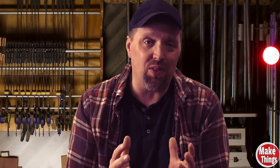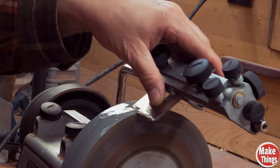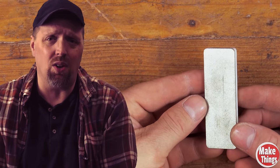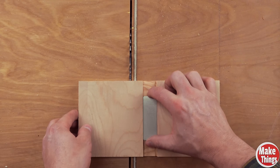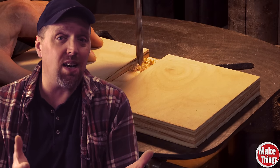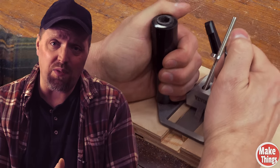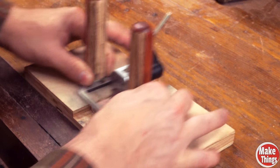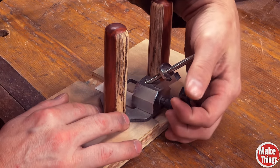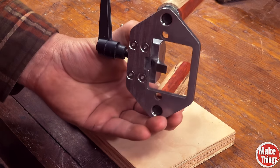I've saved my absolute favorite thing about this for last. While hand planes and shoulder planes require taking the blades off and sharpening them to a very specific angle, this isn't picky at all and doesn't need to be broken down to be sharpened. I grabbed this diamond sharpening stone off Amazon for less than ten dollars — one side is 400 grit diamond and the other is 1000 grit ceramic. I'll make a quick jig with my table saw, carving out a channel that's the width of the sharpening block, then add dowels on either side to lock it in place — you could use screws, but I like dowels. Now I just place the blade on the surface and sweep it across the stone to sharpen and true it up. Every time after this I can bring it back to this jig to sharpen or hone the blade — I'm just adding maybe a half a hair's width before I push it across. You'll want to take your block off and hit the corner up a little bit to remove any burr on the surface, but that's it.